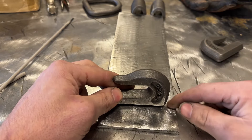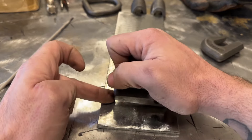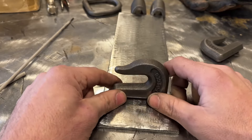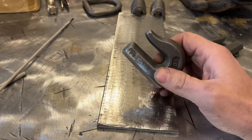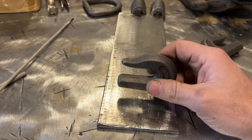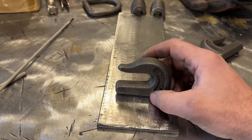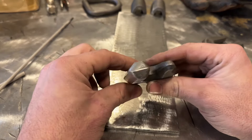Then I run a pass on both sides and grind the top so my next pass can weld around it. The reason is that all the torque is going to fail at that top point more than anywhere else, so by grinding that initial tack out and welding around it, you get a lot more potential strength. One important note: this is not a job for short circuit MIG. If you have a 140 or 180 amp wire welder, don't use it for this.